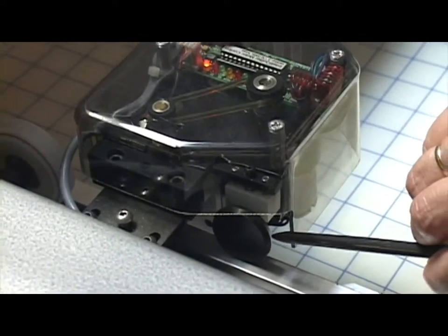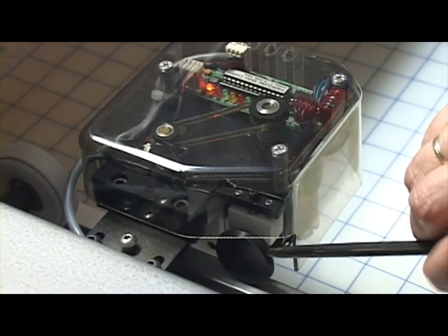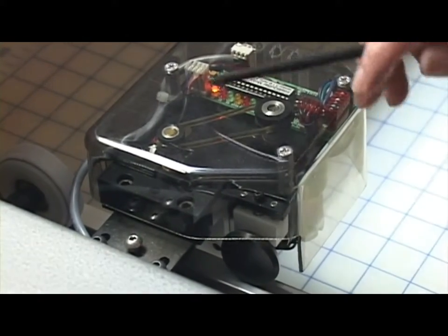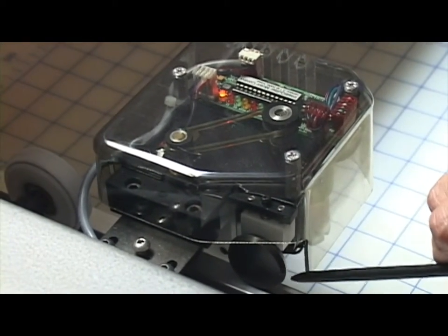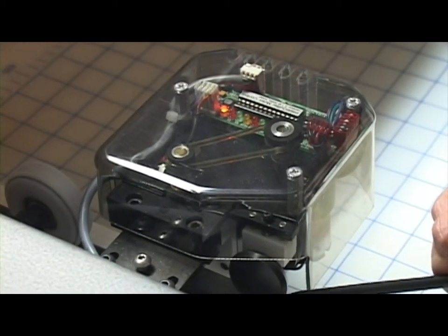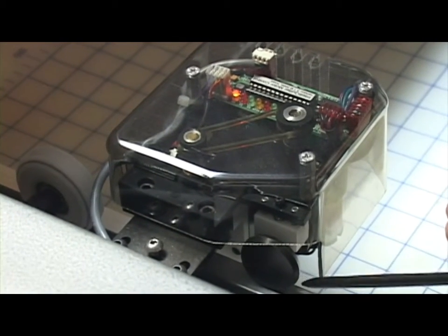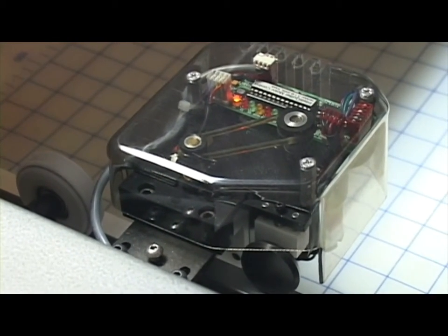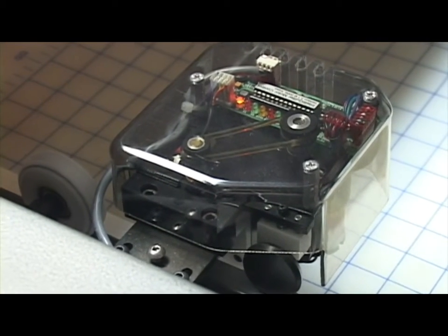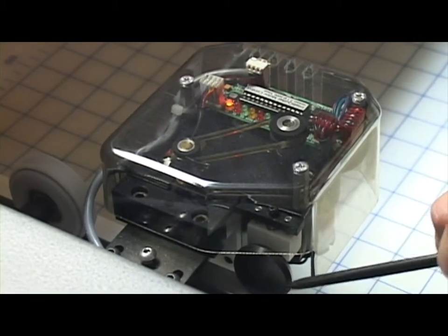And it was that wheel that was showing IQ where the needle was, and it could put the crosshairs on the screen. So even when you're in manual mode, this wheel is turning. There's no resistance, you don't feel any drag or anything, but that's the thing that tells IQ where it is all the time. So that's how, when you switch from computer control to manual and then back again, you're spot on. The crosshairs are exactly where you are, because that wheel is telling the computer.